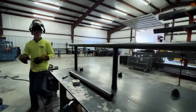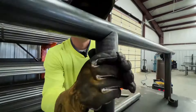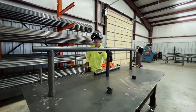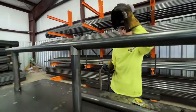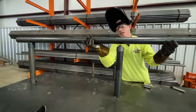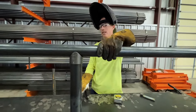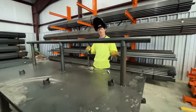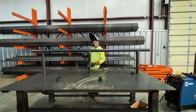That looks pretty dang straight. Now all we got to do is bring this up — see that? Now I can just tack this to that. Now that we got the top rail, all the Pipe Pals are tacked. Fits just nice, nice and snug. So I'm going to go ahead and weld all that and then we're going to do the rails next for you — show you how those rails work out. Let me get this all welded and we'll do some rails for you.